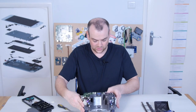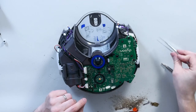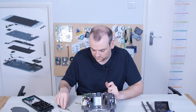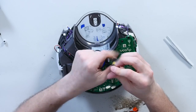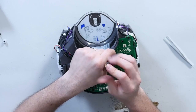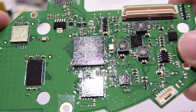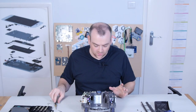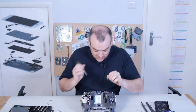Finally we're at some good, interesting electronics. There's a port here that says 'main micro' and a port here that says 'safety' — I'm going to guess they're debug headers for checking the health and status of various components. Rev 8 board. The original version came out in 2014, and this is an older one. There is a Texas Instruments big board, but they've definitely conformally coated this whole board and that's making it really difficult to read any of the markings on the integrated circuits.